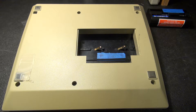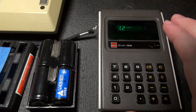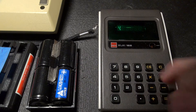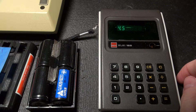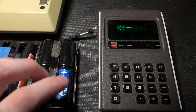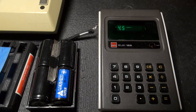There are all kinds of instructions on how to properly replace the battery packs with a modern equivalent, and you're not supposed to use alkaline because of the cell voltage differences. These nickel-cadmium batteries have a very nominal operating voltage of 1.2 volts, whereas usual alkalines run at 1.5 volts and drop off fairly quickly. NiCd is very good about staying consistently at about 1.2 volts throughout its duration. So with four of them in series, that's 4.8 volts. With alkaline, three cells in series gives 4.5 volts — that would just be a low-battery situation for these cells. The unit would have to run down to at least 1.1 or 1.0 volts on the NiCds, so running at 4.5 volts is a fairly safe bet. We'll try on a very well-regulated supply with no inductive spikes, no weird switching noise — a very well-regulated 4.5 volts and go from there.